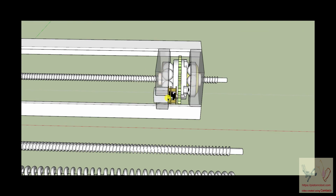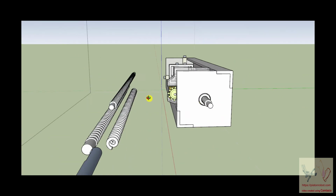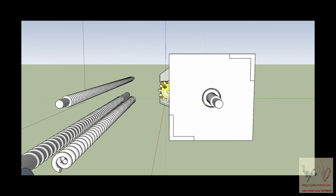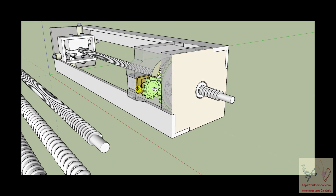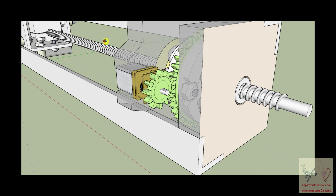Last thing we'll show you is a little tiny gear motor. A particular example of a useful or interesting principle of this. Notice that you could make that gear motor bigger. It would just stick out more. I mean, this little gear motor, it doesn't stick out very much. There it is. But you could increase the speed of your linear action by just gearing up the motor. And you could increase the power of your linear action by just making the motor bigger. And everything that you did to make the motor bigger or slower, more torque or less torque, more power or less power, more speed, all of that can be done to this motor without doing anything to any of this. I think that's convenient to have them independent, because then they become adjustable.